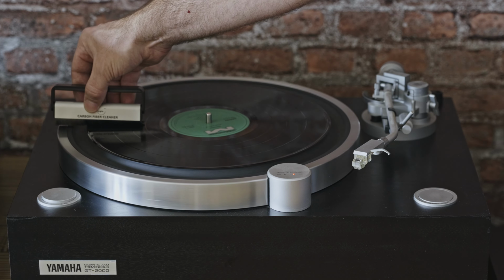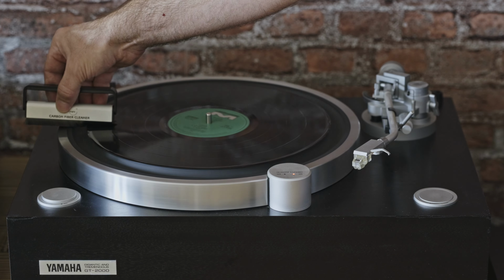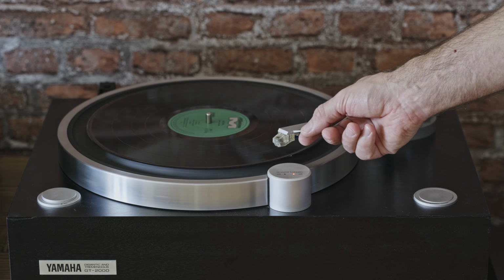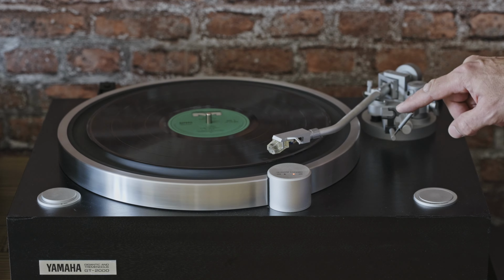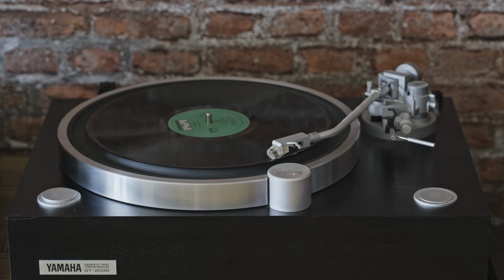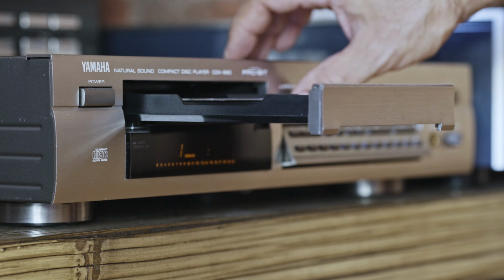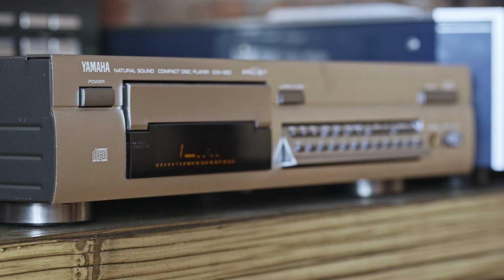Stereo separation of the CD is 90 decibels, so there's practically no chance one channel can bleed over to the other. In short, dynamic range is the difference between the quietest and loudest bits you can hear. Vinyl record dynamic range is at best 70 decibels. That means if you've got a song that exceeds this range, you won't be able to hear either the loudest or quietest bits, depending on how the record was mastered. CD's dynamic range is 96 dB, and with some dithering it can rise up to 115 decibels. So the CD is technically able to store much more information.